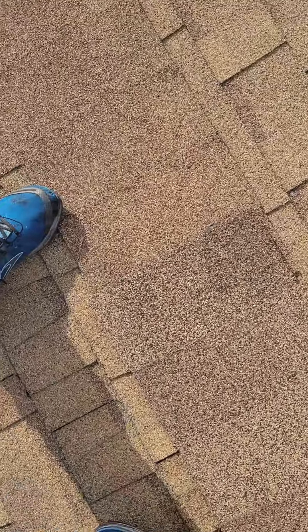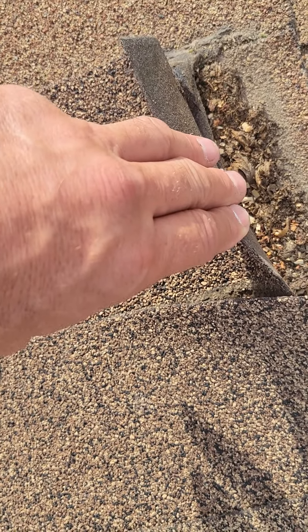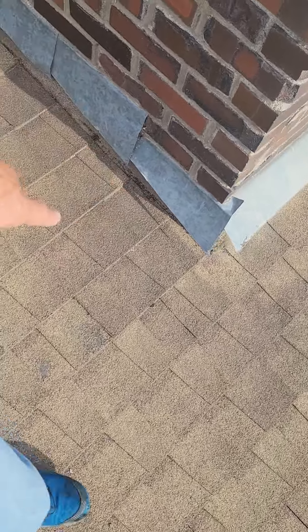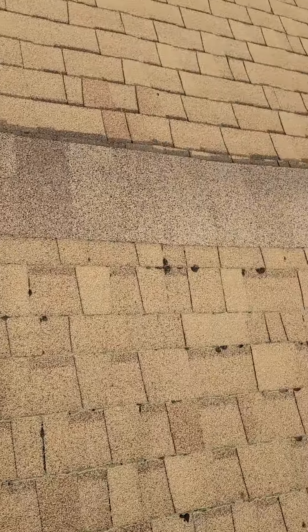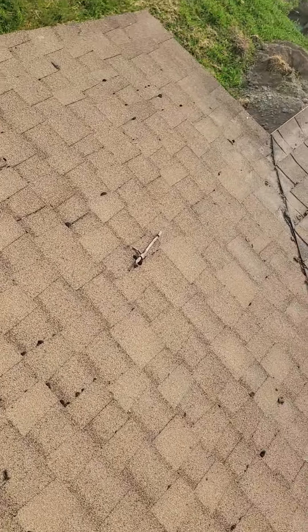This is a really serious one. You've got to put some venting up here. This ridge vent — how you install it is you nail it, but what you're doing is crushing the perforated edges so it's not getting any air at all. This isn't working at all. You've got to throw it away and put a new piece up. No more Mickey Mouse roofers up here. This secondary flashing that's sticking out needs primary flashing going underneath the bottom of it. This is a very difficult roof, and what happens is you keep roofing it and it's not done right.